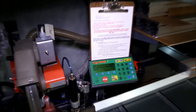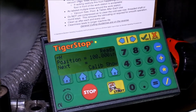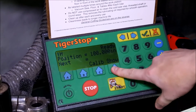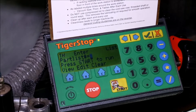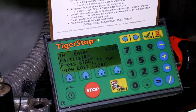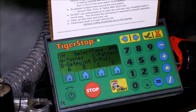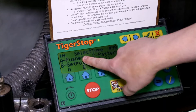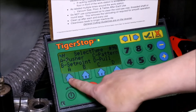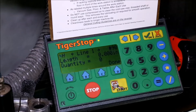So first, I'm going to show you how to make your Tiger Stop push. The first thing you have to do is access your list interface. The way that you'll do that is you'll press the show soft key, and then you'll see you've got the list soft key. Now you'll enter what part list number you want to enter — you can do 1 through 100. I'm going to do list 90. You can see right on the select type screen is the pusher part list, and that's what we'll be running. So you select pusher.